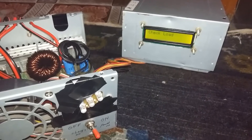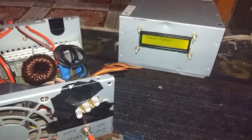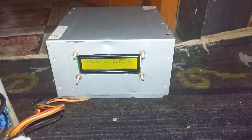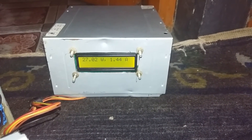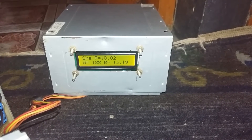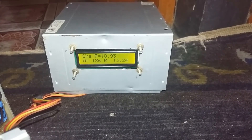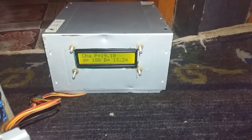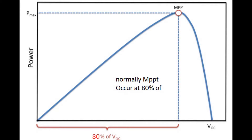Let me turn on the power supply. As soon as I turn it on, first it will check battery voltage to decide how many batteries are connected and what the voltage level of the system is. After that it will check whether it is okay to turn on the load or not depending on the voltage level of the batteries. Followed by testing the panel to check whether it can charge the batteries or not. Finally, it will decide what the duty cycle should be for the current situation so that MPPT can be achieved quickly and easily.